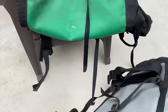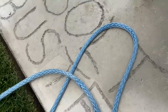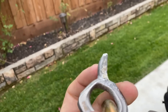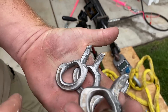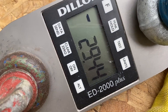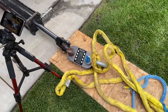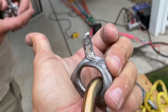So this started to bend at 3.5 kilonewtons. This is a unique bolt in how it pulls out underneath the surface — these all do that — but this bolt is unique in how it breaks halfway down the stem. We got a pretty consistent result here. It's still higher than our original test when we pulled normal, but it is lower than pulling it unfavorably, which is opposite of what I thought was going to happen.